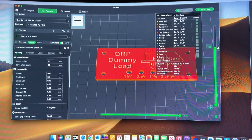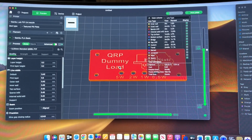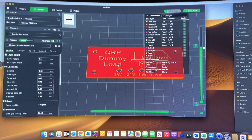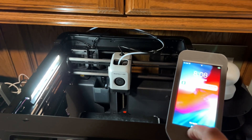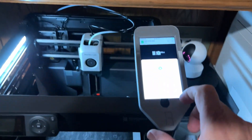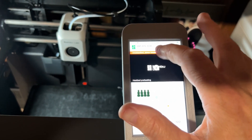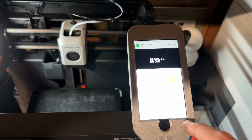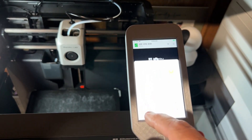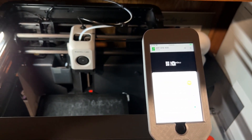So I'm going to change filament, because right now I have some transparent filament in the printer that I was doing for some LED tunnel for this thing. But I might as well show you how to change filament. So I did this little mod here so you can put an iPhone on here. I'm going to turn this to my pen. Come in here — I can see it's not connected. It's reconnected. Go to your printer, and then what I want to do is turn up the heat. Hit Done — should start heating it up.